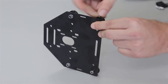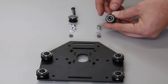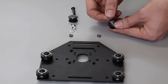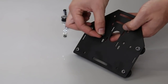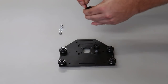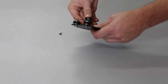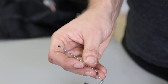Now I'm just tightening this down — you want to get it fairly tight but you don't need to crank on it too hard. Next, we're going to attach the idlers to the carriage. Make sure they're oriented correctly so that the open side faces towards the plate. On the backside, just another washer and a hex nut. You can align the spacers in an idler at any point. Here we have three fully assembled carriage plates.